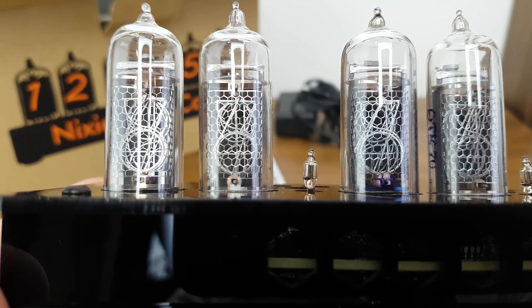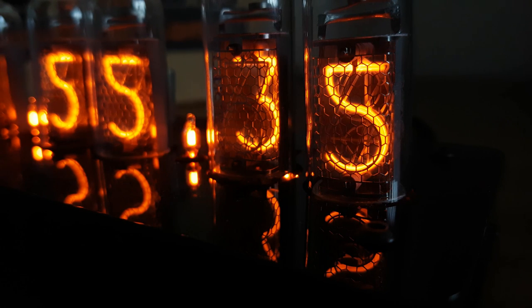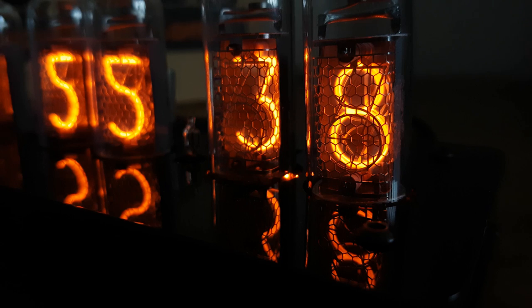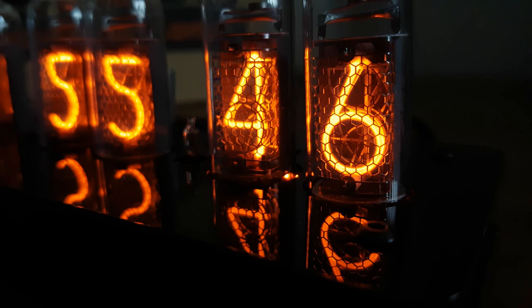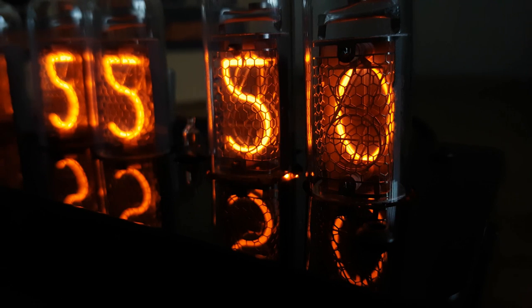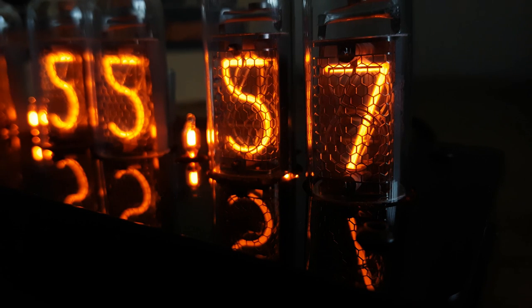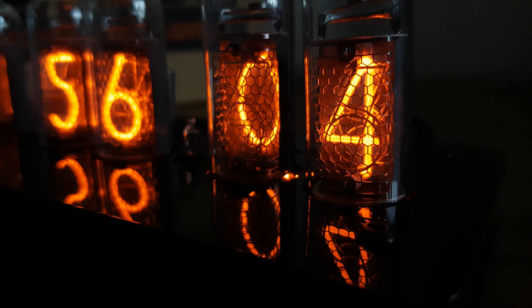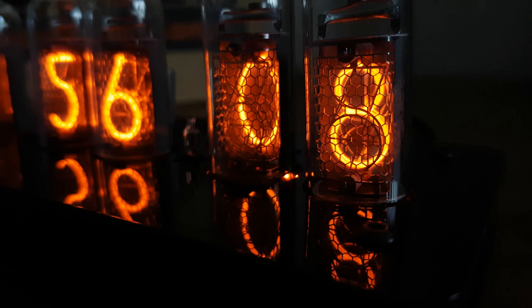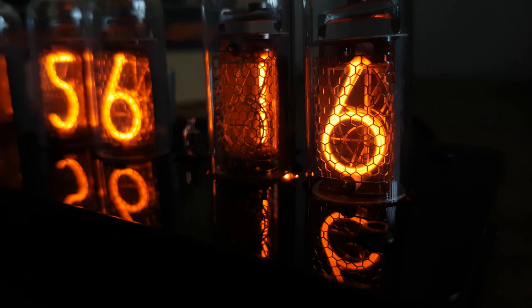The next thing is to get it plugged in and see if it works. Everything's now plugged in and up and running. The power pack that came in the box was dead on arrival, so I've swapped that out for another one and everything is now running as expected. Focusing in on the last digit of the seconds, I thought it was useful to show you how a Nixie valve works. It's made up of different numbers which are all individually stacked in the tube — hence the tubes are quite large — and as the clock scrolls through the different numbers you can see the characters moving forwards and backwards in the rack. Also, every 10 seconds or so it'll do a number scroll, which helps preserve the life of the tube.